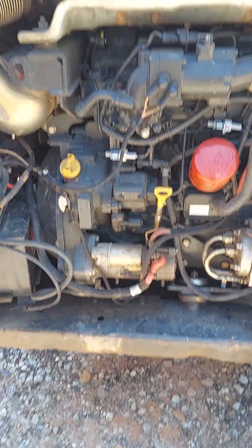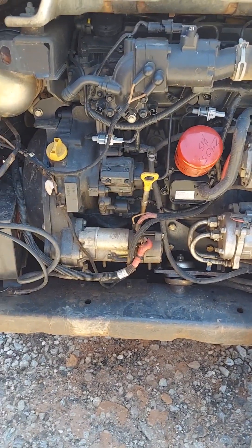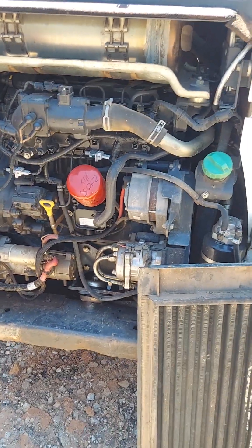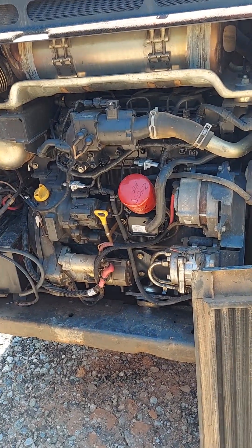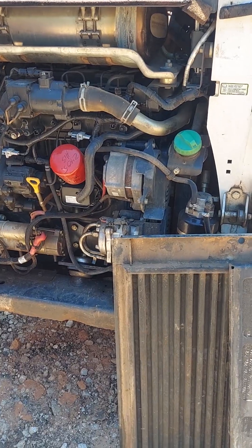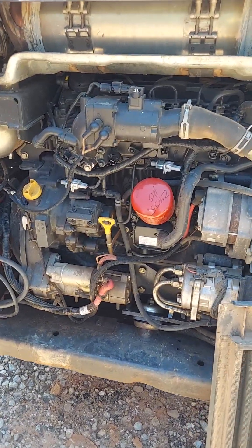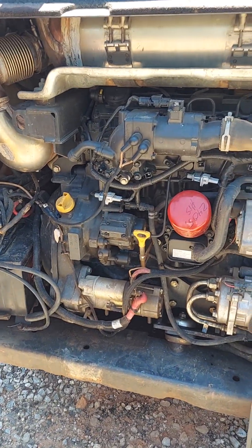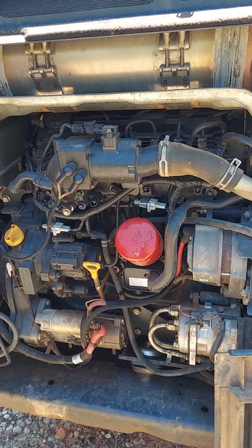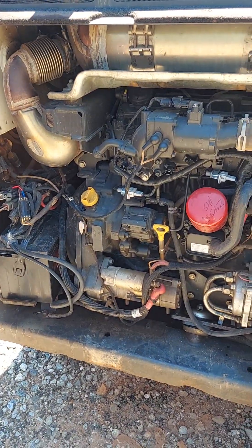It fixed the issue on this machine. And it's not only on the 750s — it's also on newer Bobcats with the exact same setup. I made this video because I've read posts about this code or codes related to dosing or tempering faults on the DEF system. Giving that sensor a good clean-up fixed it — it's been running great for about 50 hours wide open and still running strong. Check your wiring, check the connections, make sure the sensor is not blacked out or full of soot.